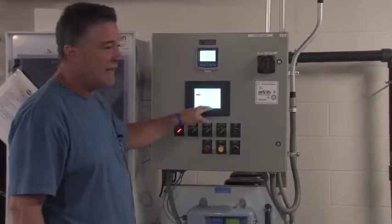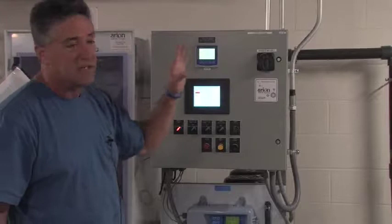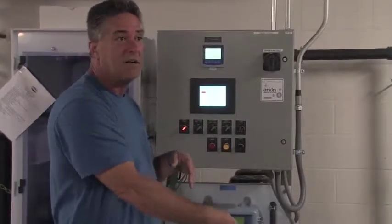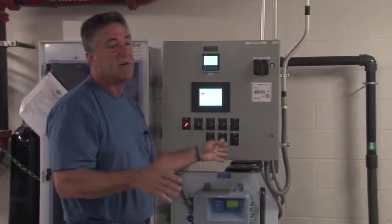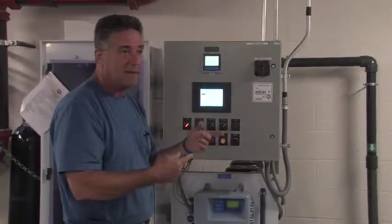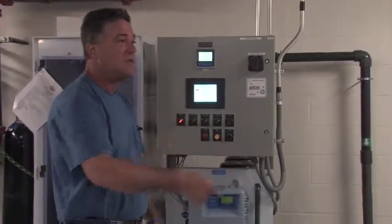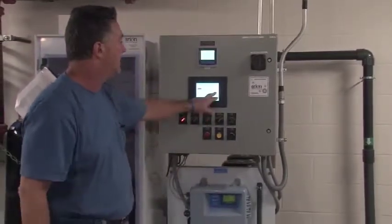There's a delay for the low pressure. What's happening with the system is there's a pit next door and it physically sucks the water out of the bottom of the pit, then puts it back in. That's why we put in a delay for low pressure. If this thing's been sitting and needs to be reprimed, we've got a valve on the bottom, and the delay is there just for the pump to catch up, then send water back to the tank.